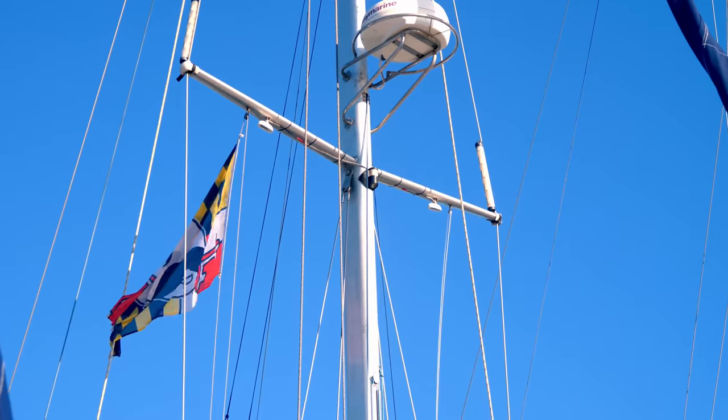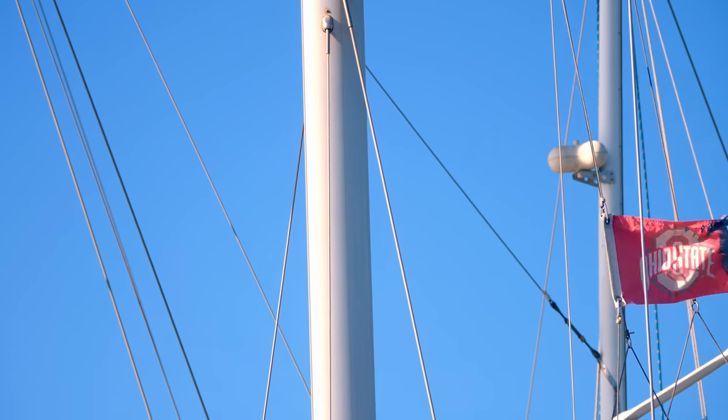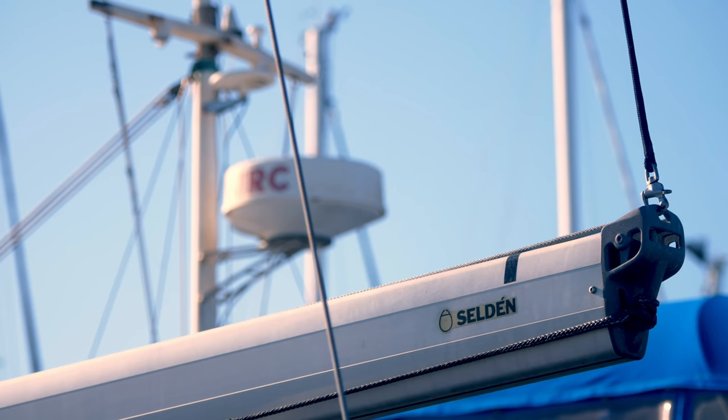My name's Kim Weir, I'm a sailboat rigger here on the central coast of California, around Ventura and Channel Islands harbors. I've been doing sailboat rigging here for the last 30 years. My opinion on the difference between mast finishes, anodizing, bare or painted, I definitely prefer anodization. A good anodizing job on a mast will last a long time. I've seen a lot of old spars where they're anodized and the mast is in very, very good condition.